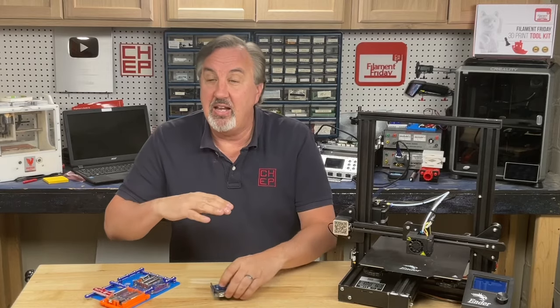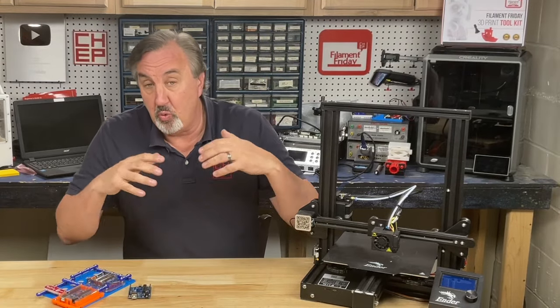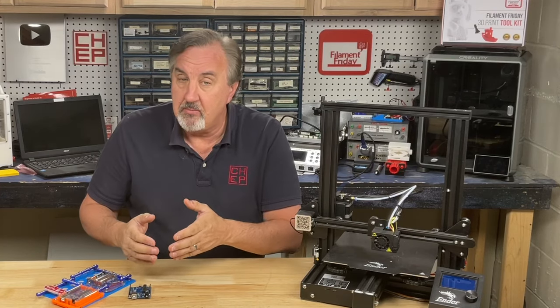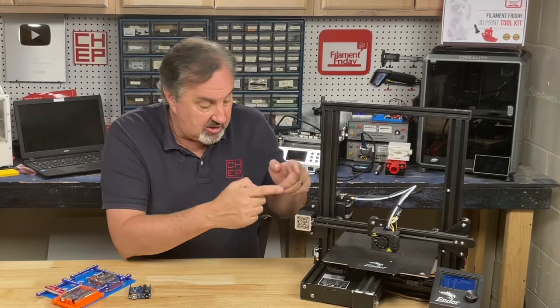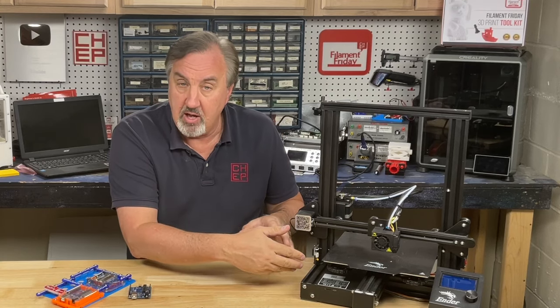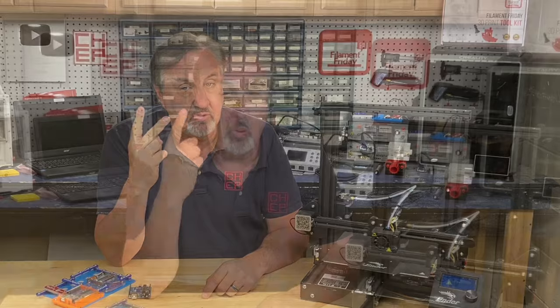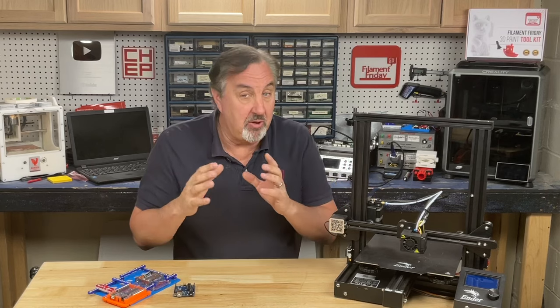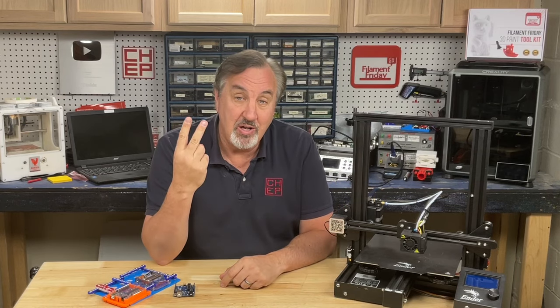It expands from there. If you want to control a motor or a relay, you control it with a high or a low, but there's circuitry between the microcontroller and the object you want to control — such as a stepper motor on a 3D printer. There are stepper drivers or individual chips on the control board. From the microcontroller, they only require two signals: one is a high or low to tell it to go forward or reverse, and the other is just a pulse — high, low, high, low — and every time it goes high then low, it tells the stepper driver to advance the motor one step. Everything else is handled by that stepper driver, so from the microcontroller, all you're doing is controlling two digital outputs.